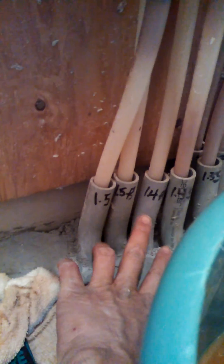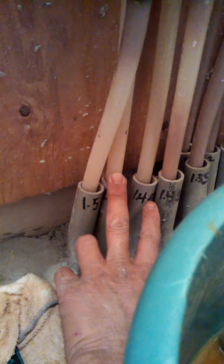After you get all the water out, you want to be putting pressure onto each circuit looking for your leak. We found that the leak in question is either in circuit 1.5 or 1.4 — you have two per each because you have a supply and a return. We already pressurized 1.5 to about 60 pounds and it's holding. We pressurized 1.4 and it started to leak out, and we found it. In a few seconds I'll go over the flooring and how to track down the leak.